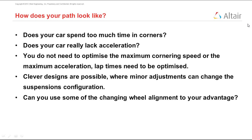Okay, so I have a question that says, is negative camber better or positive? So as we discussed, with the absence of any other data, we want the tire to stay upright as much as possible. That is, have zero camber whenever possible. So if your initial camber is, say, negative, and your IC is placed at a certain place such that when the wheel moves up or down, your camber comes towards zero.